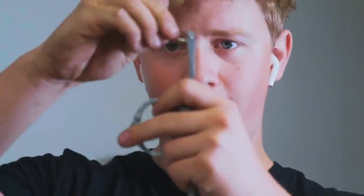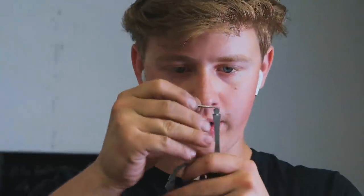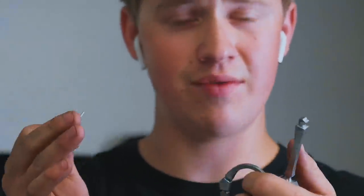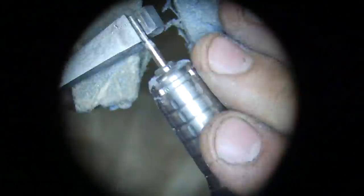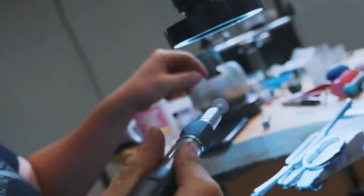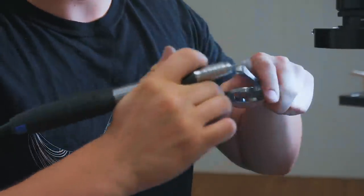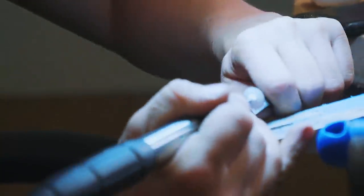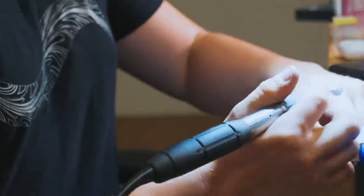As you guys have seen, I've been carving that fuller around this part of the end of that quillion. I'm going to go ahead and clean that up with this diamond burr here — I think it's going to be small enough that I can get in there and get a nice radius all the way around, and it should leave a pretty decent surface finish. That diamond burr did a fantastic job of cleaning out and smoothing the inside of that little fuller. I'm going to take this rubberized abrasive disc and try to go around and clean up the inside a little bit more because it's still a fairly rough finish.